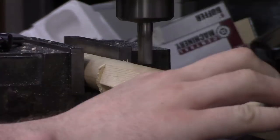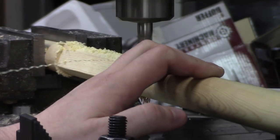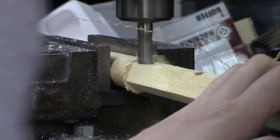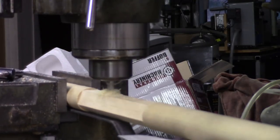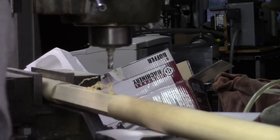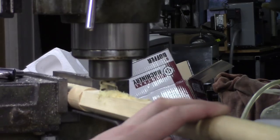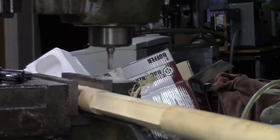And once I was done with the pentagon, it was time to move on to drilling some mortises for tenons on the flanges to socket into. This mortising process was pretty similar to the initial pentagon process. I just went back around again using a pentagon screwed to the back of the dowel as a guide and drilled the mortises into each side, and again this was the first go around, so I ended up redoing this all off-camera again.